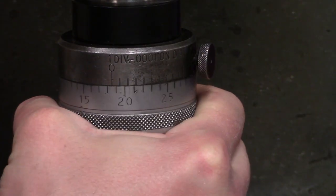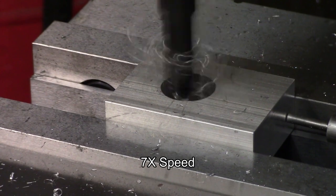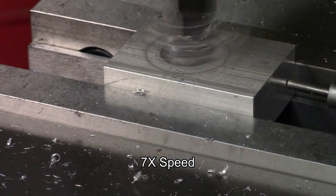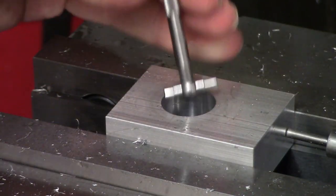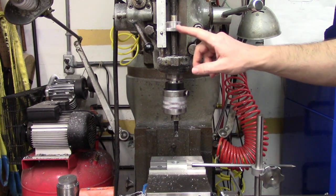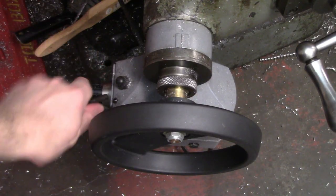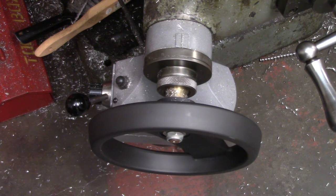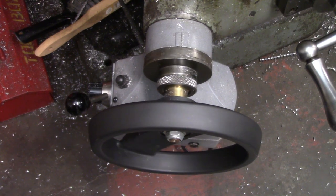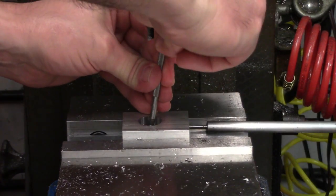The boring operation was carried out the same way as the base, using my tenth-set boring head. Whenever I use a boring head, I want to make sure I know exactly how that boring bar is behaving, so I take multiple cuts at the same depth of cut with a measurement between each one. This lets you know how much flex is happening in the cut and is an absolute must for accurate work. To make measuring easier, I extended the quill down so the bar is close to the material and set my quill stop. I used my knee power feed to make the cut because the power down feed on my quill doesn't work very well — there is a lot of wear on this machine and the down feed doesn't want to stay engaged. At the end of the cut, I can just retract the quill and have plenty of room to get my telescoping gauge into the bore for the measurement.